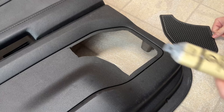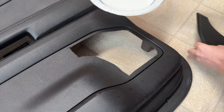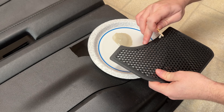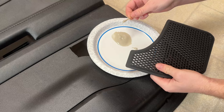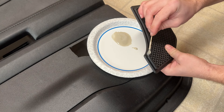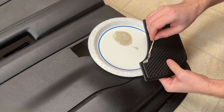Once you have a good fit, take a two-part epoxy — ideally one formulated for plastic. Apply the mixed epoxy around the inner edge only; avoid the outer edge. If it oozes out, you can wipe it before it dries. You can mix it with a toothpick, or use a dual-cartridge epoxy syringe for a cleaner application.